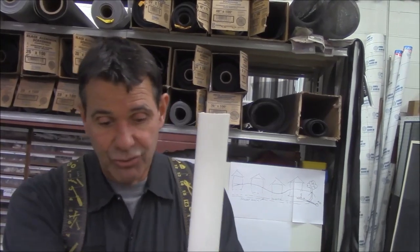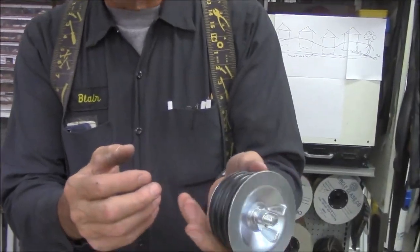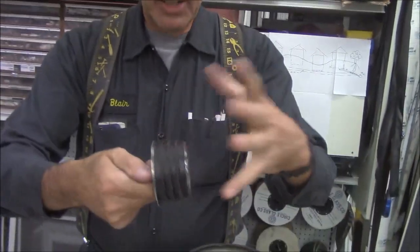There are two drains in the house. The standpipe needs to go in the drain that's connected to the weeping tile. You have another drain in your house in front of your laundry tub — this is common in our area in St. Clair Shores, but it's industry standard. In front of the laundry tubs, we can put in a test plug. This is a three-inch test plug, just like a thermos bottle plug. You tighten the nut, it expands, it seals, and you put it into the drain.